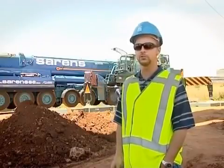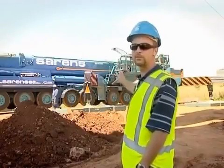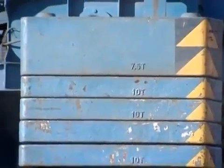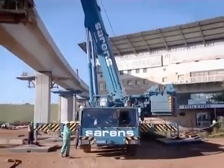When you bring the machine onto site, it comes in a base model. It would be running on the tires. Obviously it's set up to lift as it's standing now, and then you'd have to pack on the counterweights onto the machine. The heavier the lift, the more counterweights you'd pack on.